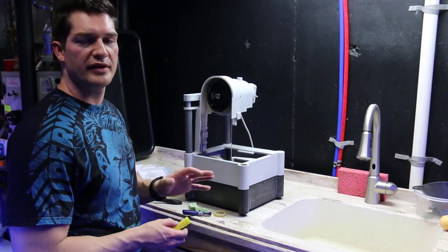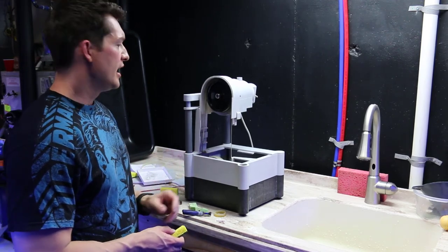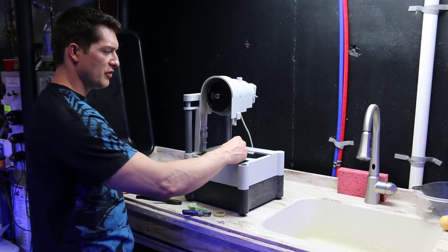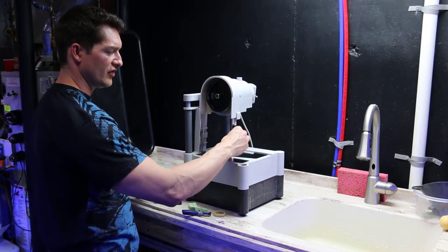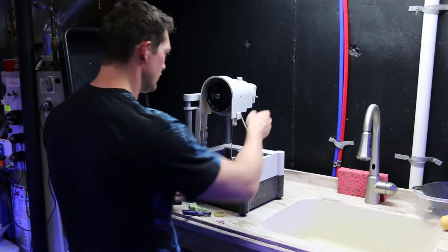Turn on the blade, put everything back, put some water in, and test and see if it's running true. It may need a little adjustment, but the blade should be pushed back against the guides. If it's running correctly, it will not fall forward.